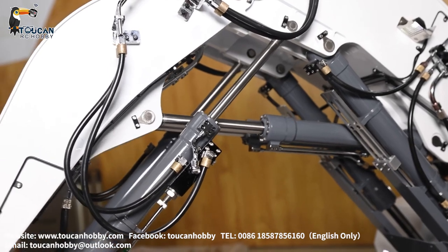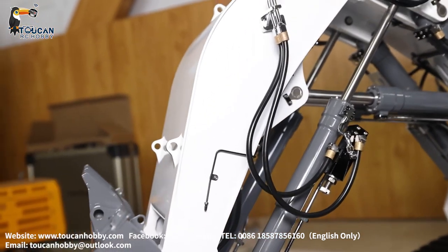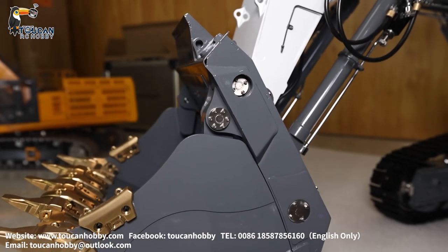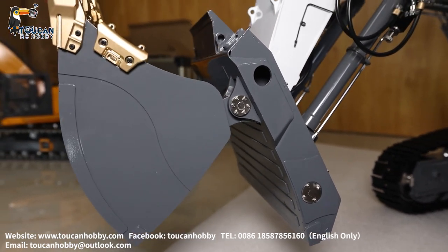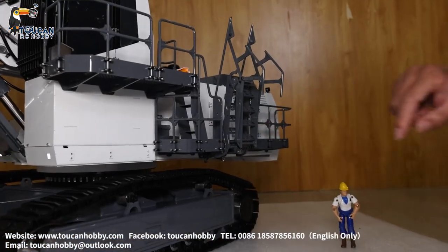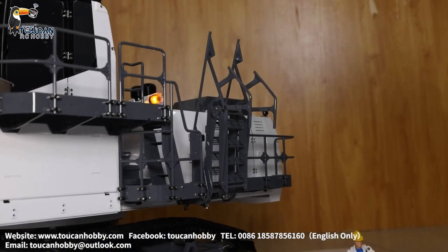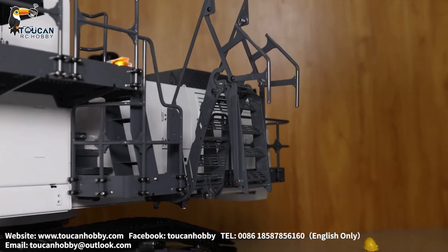Go down. For the bucket — reaching out slowly, coming back slowly, rising up, slow down. Opening the bucket — speed up, slow down, stop. Close it. Speed up. The ladder operation — no need mix control because it's a very small cylinder. So only start the pump at low load. Putting down the ladder — it can be moving very slowly depending on how you finely adjust the valve. Speed up.